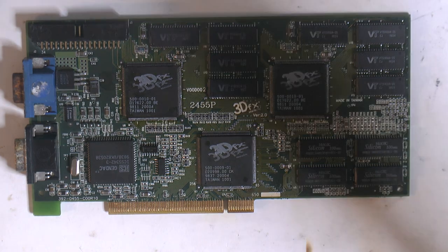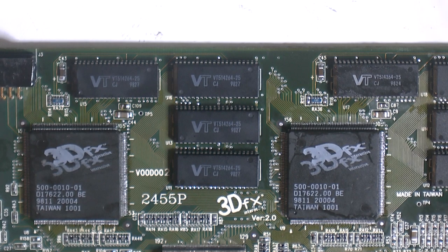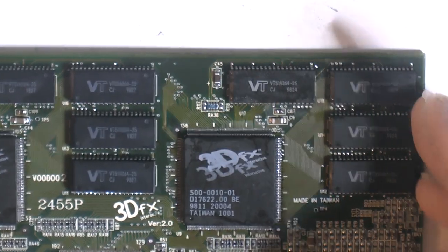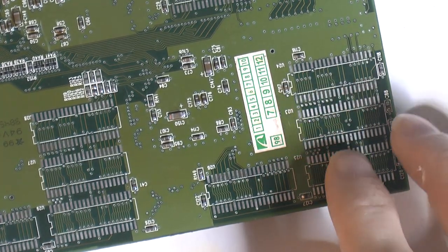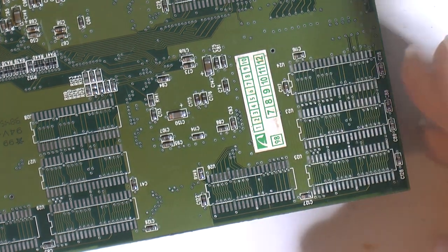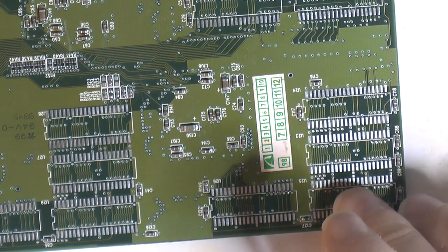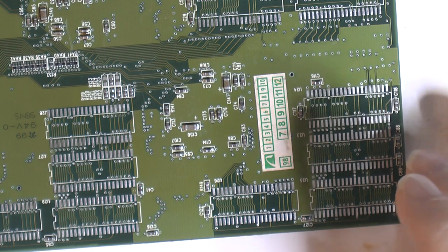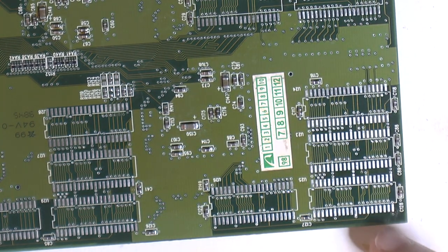And what is it? So eventually, I noticed that when I got the card working the first time, like detected and running but with the artifacting, if I touched the memory at the back side before I removed it, it was flickering. The artifacting started to flicker. And the same thing when I removed these. So I noticed when I touched,